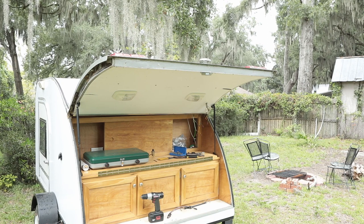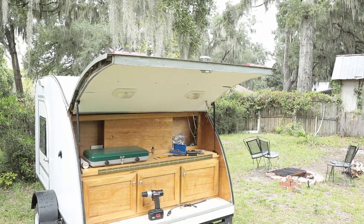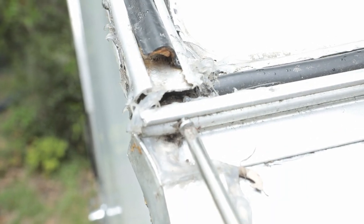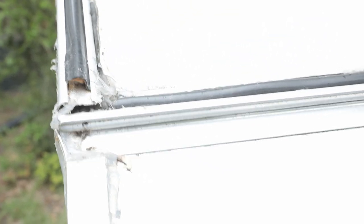I've got the wiring apart. The next thing I need to do is take out the set screw that holds the hurricane hinge in. On your hurricane hinge, there's going to be a spot where a screw is put in — you may have one or two depending on how it was designed, either in the center or two on the ends. The function of this screw is to keep the door from sliding sideways on the hinge when you don't want it to. I'm going to take that out, and that will now allow the door to slide sideways on the hinge so I can take it off.